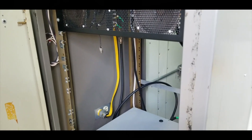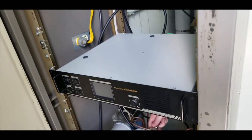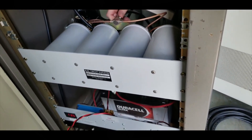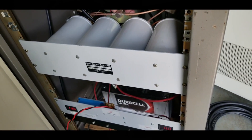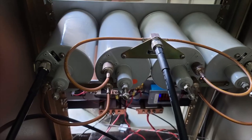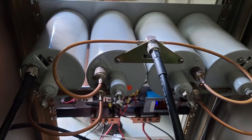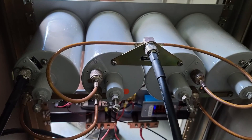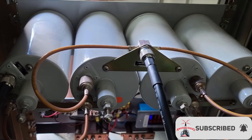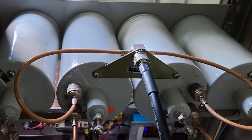Here's the open space where the duplexer used to be — that's where the D-Star is going to go. We didn't get a shot of the D-Star installed in that top portion; the speakers came out as well. We're finishing up the duplexer reinstallation at the bottom. As bad luck would have it, I screwed in the cables incorrectly — I had the wrong cables on the wrong input — so AC4DM had to come in and do some quality assurance. Duplexers are a wonderful piece of equipment to make sure unwanted frequencies don't hamper the frequencies you're using for the repeater. They're passive in their utilization, but they work great, and they're not inexpensive.